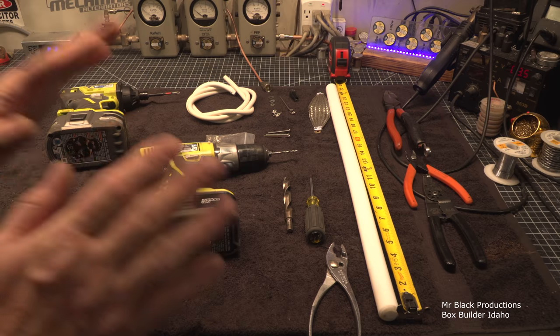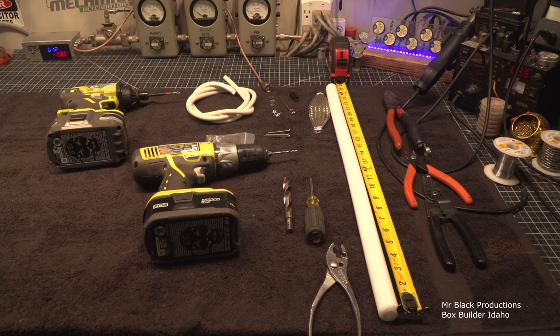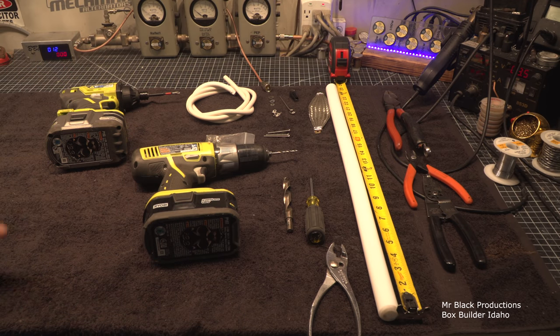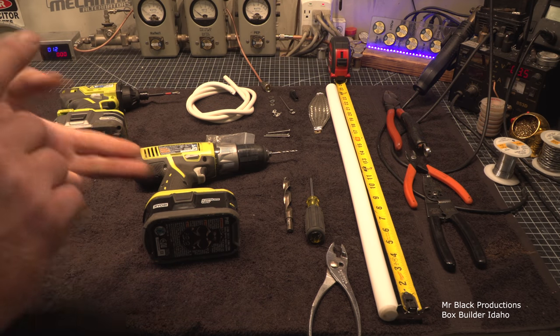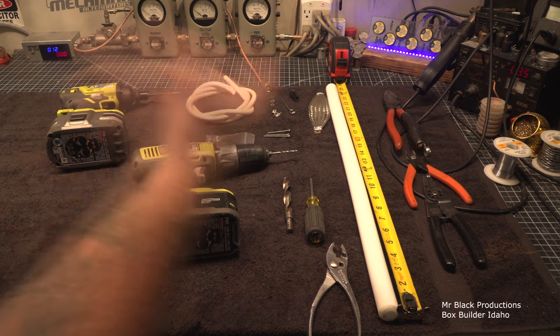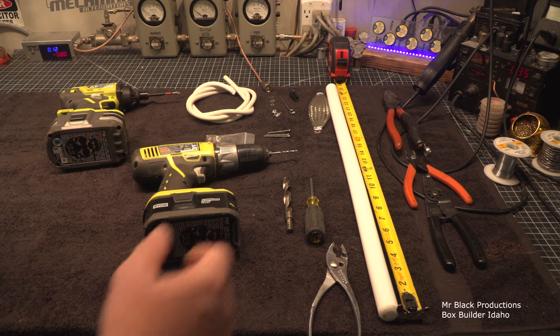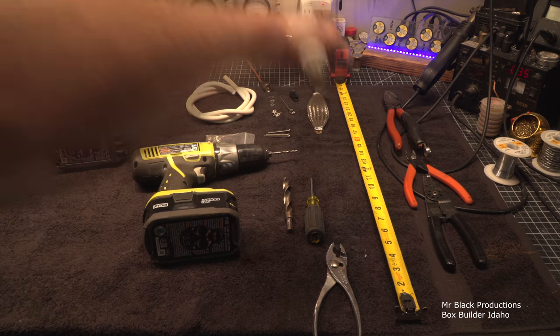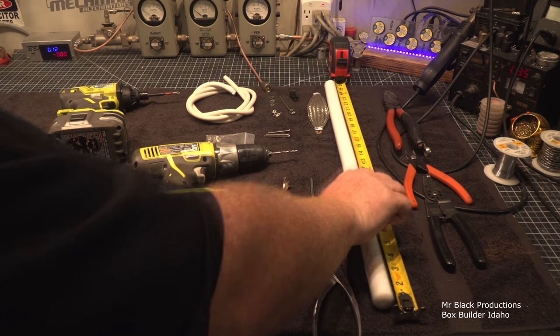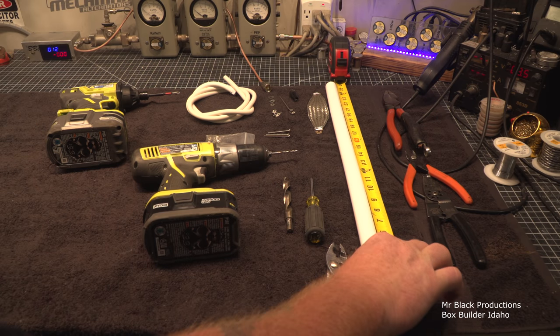Just putting this in perspective. So going into this with our eyes wide open, after we have verified with a meter that the voltage is depleted, okay, we're now going to go in and make sure that there's no little crispy little demons left inside the cabinet. We're going to take our little wandy wand and we're going to go, okay, there's no high voltage left on any components. We're not going to die.